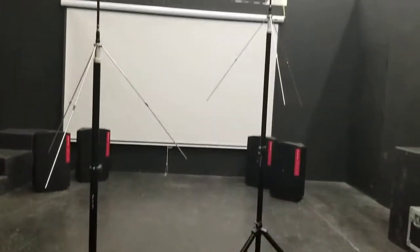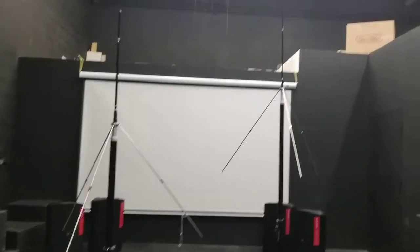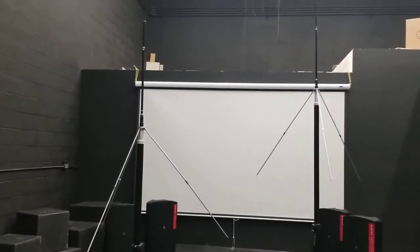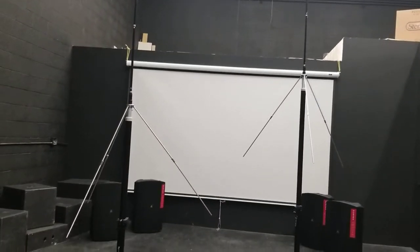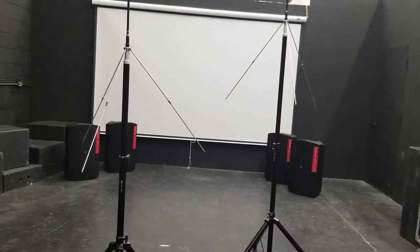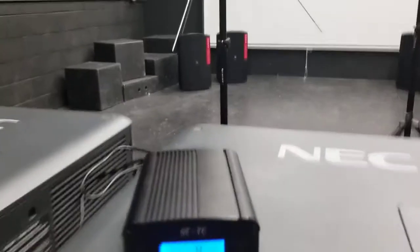There's one more tip I want to give you about setting up your transmitter and antennas. You want to keep those antennas probably around 75 feet from the closest vehicle. What happens is, particularly if you're on the high setting, that will overpower that first row of cars, and the radios will just be complete distortion. That might not happen on the low setting, but it certainly happens on the high setting. So make sure you position your antennas far enough away from the cars, and that way you'll never have an issue or problem with that.